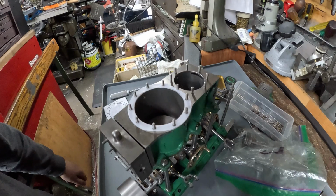It's quite easy with the knife to follow around the metal edge to cut out the profiles, the ID and the OD of the gasket in this case. I had a few more filmed, the valve chests, etc., that I could show you, but I'm starting to feel a good video is a short video, so we'll leave it at that. As you can see, I got pretty good results with this gasket without too much fuss.